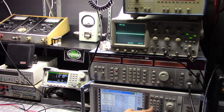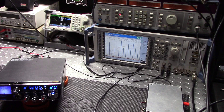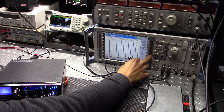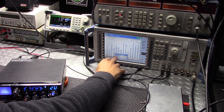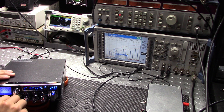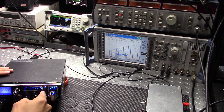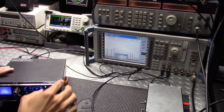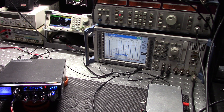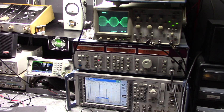Just a hair over — really nice. These go a little bit over 100% modulation, so if the radio supports it we'll do it, no problem. Now showing it on sideband: I'm getting a multi-tone dual-tone set up using 1900 and 700 hertz. Taking it over to the Icom screen on lower sideband — there's our dual tone.